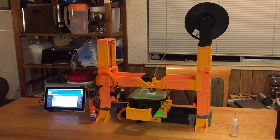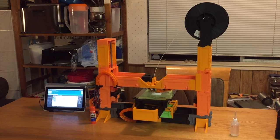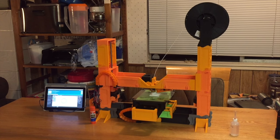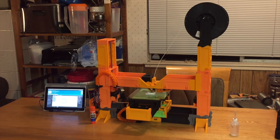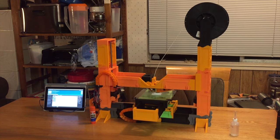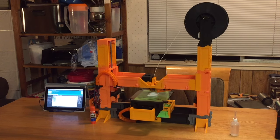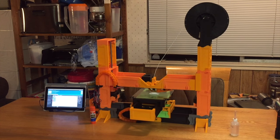I took as many of the standard things that you normally see in a lot of these printers — like sliders, rails, belts, pulleys — and either eliminated the need for them or replaced them. For example, instead of having metal sliders or slider bars, what I have instead is plastic printed parts that have built-in sliders. For example, I have this V-rail design here.